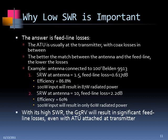Satisfactory operation requires an antenna tuner. The far-field response at higher frequencies is pretty complicated. You might say, 'I've got an antenna tuner right next to the transceiver and I'm getting fantastically low SWR readings into my transceiver — the power amplifier is happy. Why am I not happy?' The answer is feed line losses. If you run 100 feet or more of coax and it's not very low loss coax, you're going to start to lose a significant amount of power.